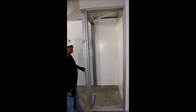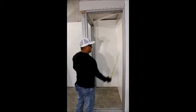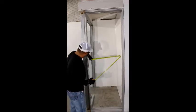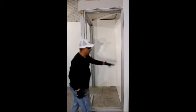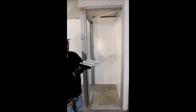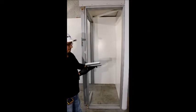Now we will show you how to install a horizontal mullion to a corner post. You will use the same RA107 clips you used to install one side of your base. Your horizontal mullion is cut to the daylight opening width of your window. For one and one half inch trim, you will be using the RN61 horizontal mull base, along with two pieces of the RN51 glass stops. On two inch trim, you will use a RN50 base with a RN51 glass stop and a RN54 glass insert to make your horizontal mullion.